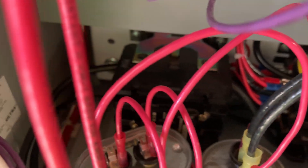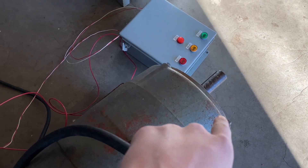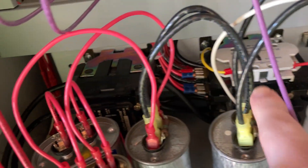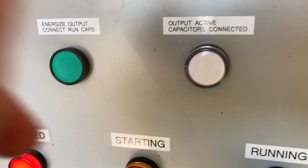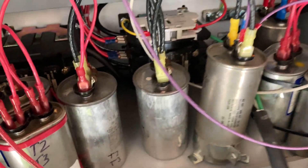That capacitor is the input capacitor that gives power to the idler motor — that's what this is called because this motor doesn't have anything hooked up to the shaft; it just idles. The mechanical load on the motor is internal, just from drawing power from the generated phase — that's why it's called an idler. This contactor gives power to the idler motor, and this contactor here is the output. When you press this button — and it only works when the thing is running — it will connect your output to your newly generated three-phase power.